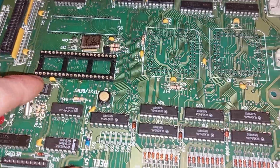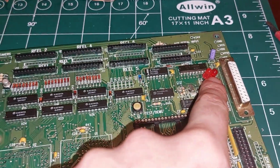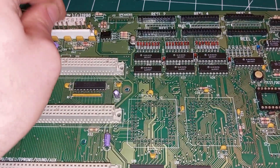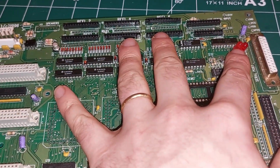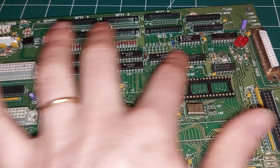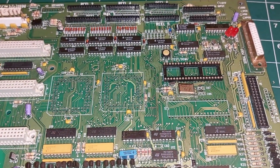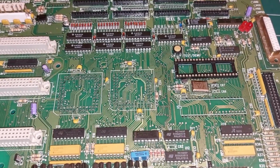I've cut a pin on this, so I changed it, and I fixed my lamp stuck on problem. That was just the connector with my 12 volt connection had come out of the power lead, which gives you that weird effect where it doesn't really stop the board running, if I remember, but it jams those lights on because it's a crafty way they've connected these and this to this. It's something to do with pin 10 on here. It lets you know straight away if you've got a rail down on the power supply, but I don't think it actually stops it running.